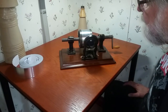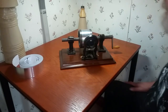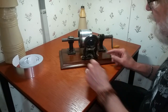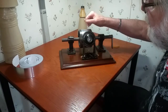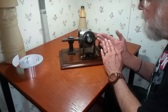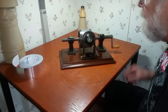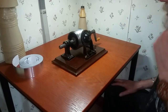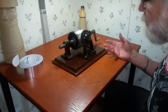With careful preparation and adjustment, you can make much better recordings. I just got this repaired, and today I've only made a few recordings on it. The adjustments are incredibly small and have to be extremely precise. You notice there are two pivots on either side of the sound box. You have to adjust the sound box left and right to make sure that embossing point is centered between the grooves on this mandrel. Then you have to adjust the depth of the embossing point, so you don't go too deep and tear through the foil, or not deep enough that you're not indenting it to get a good recording. It takes a lot of preparation.